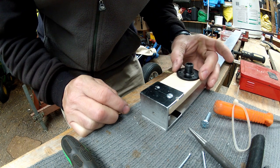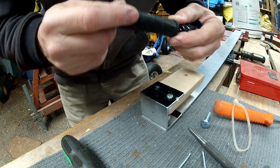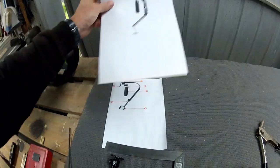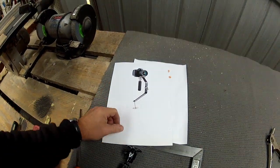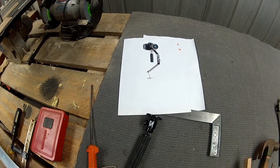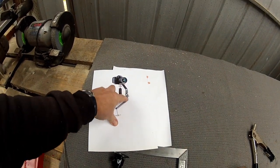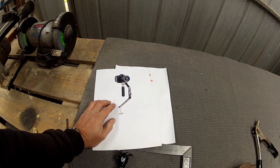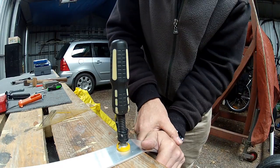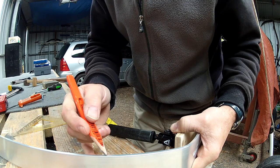I've come to sort of balance it, and that's going to be my handle attachment point. Looking at that, the bend starts pretty much straight after the camera slider thing, so I reckon we can start to bend it about there. What sort of angle would that be? Probably about 45 degrees — because that's 90 degrees to that, so two 45-degree angle bends there makes 90. It could be a little bit more than 45. Somewhere like that.